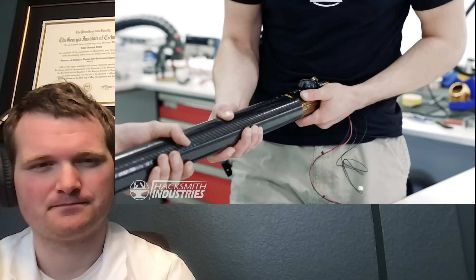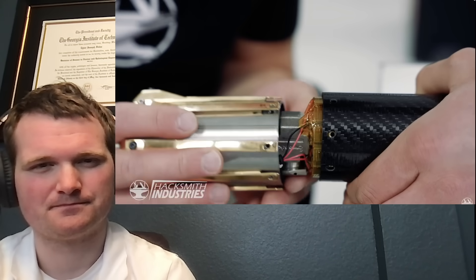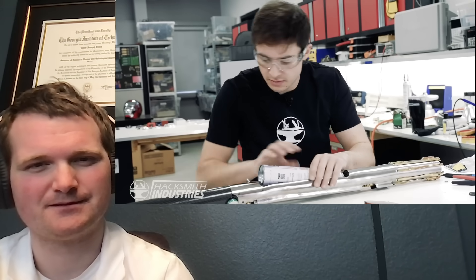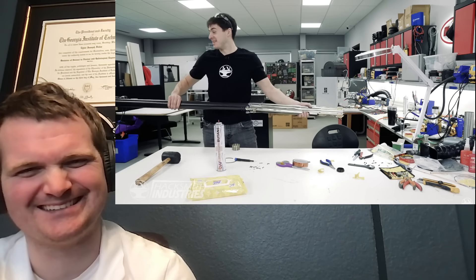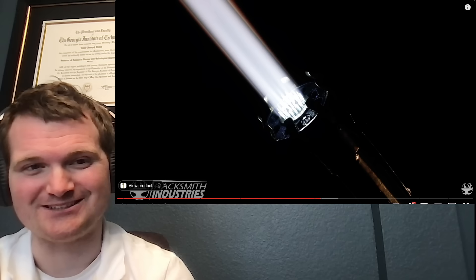The carbon fiber tube is attached to the oxygen tanks, followed by the stainless steel body tube, bottle heater, and fuel assembly. Decorative brass pieces, button cover, sliding door, and butane cylinder are installed. And there we have it — a fully completed lightsaber. We just managed to cram 11,000 watts, or 36,000 BTUs of heat, at 4,500 degrees Fahrenheit and over 3 minutes of runtime — about 10 microwave ovens worth — into an untethered lightsaber polearm. Pretty cool for miniaturization.